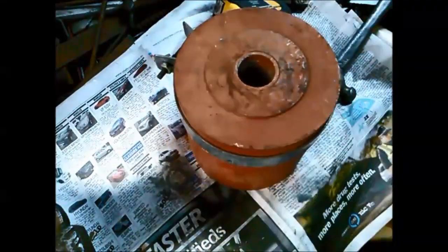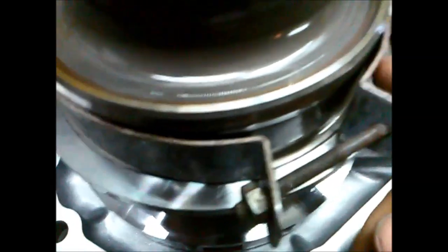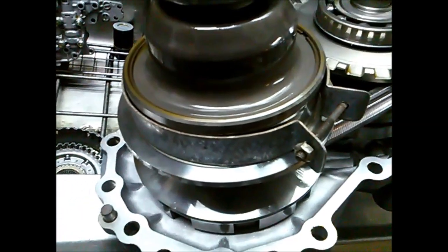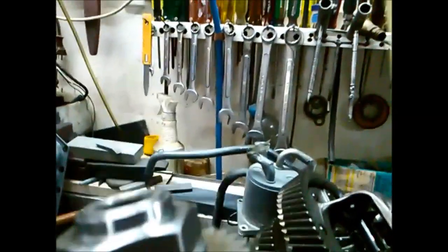I'm going to shape it around the drum. You can see just here I need to fine tune it a bit, just make that a little bit more round there on the ends. It's looking good and it just sits under that little step. To the bottom there I just need two bits of steel, going about seven and a half inches.